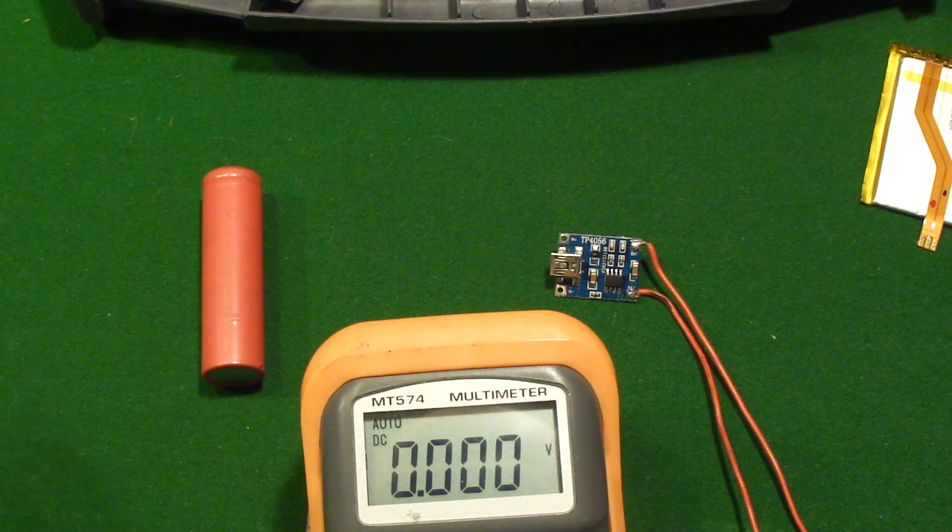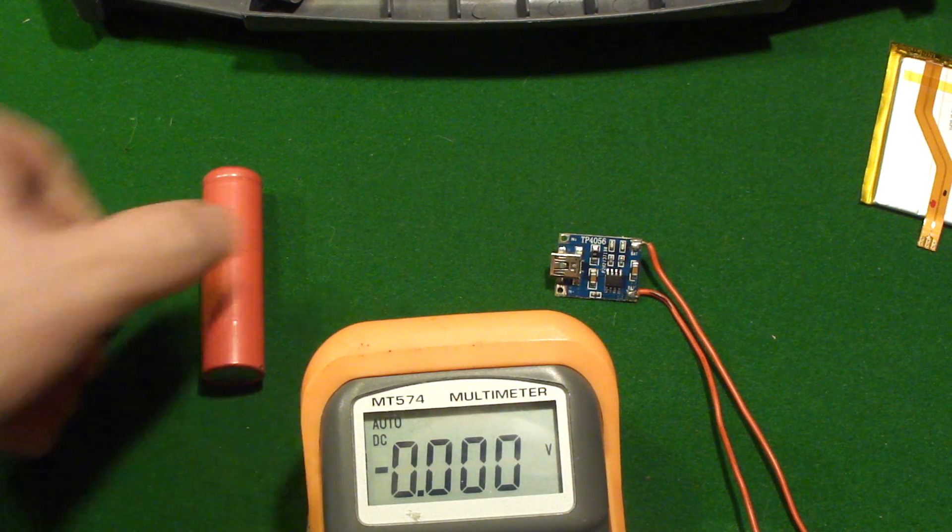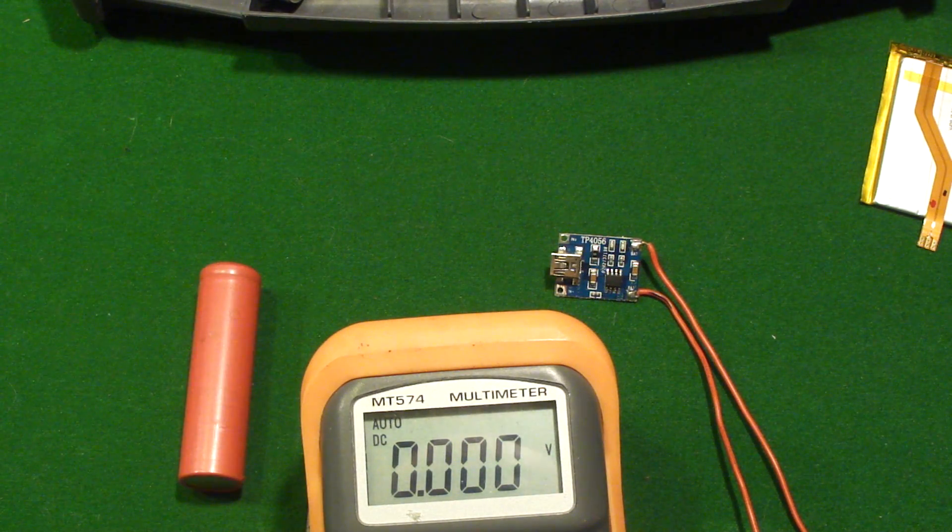If it's a very low draw project — say you've got an Arduino — it's small. The Arduino is happy with 1.8 volts up to about 5.5 volts, so one of these could directly power an Arduino for a very long time, probably 100 hours for many Arduino projects. But you might have some other units that require 5 volts in order to work.